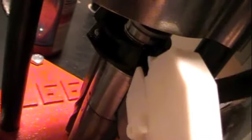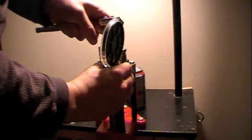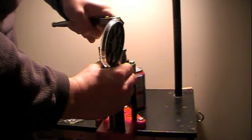What you want to do is line this up rotationally so that the safety prime device is in perfect alignment with the priming arm here for the priming cup. So when that rests, these things should be lined up so that this will slide over that priming cup smoothly without fetching up. See, just like that. Boom, prime, prime. And then just tighten down that bolt. Support the plastic arm gently as you torque this bolt down, and do it gradually.